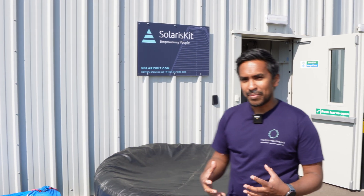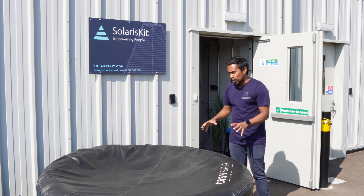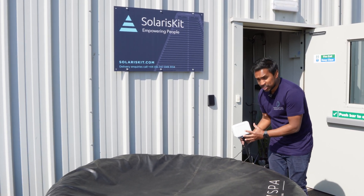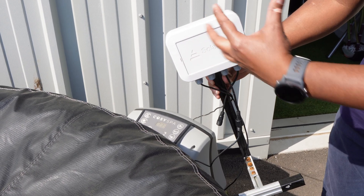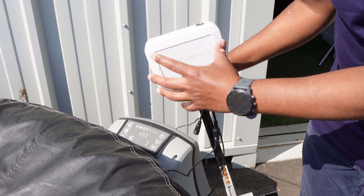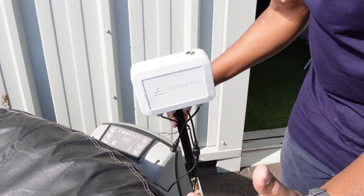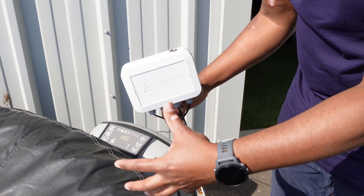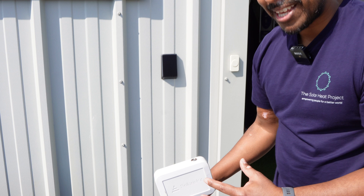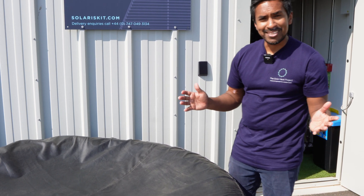To automate all of this, we include a small temperature controller which is constantly measuring the temperature of the system. Our controller is mounted in a box housing a PCB with our electronics and software. It measures two temperatures — one of the hot tub and one of the solar collectors. Based on our software, if there's solar energy available and your hot tub needs heating, it'll turn the pump on and start the heating process. When it reaches temperature, it'll just switch the pump off. It really is just a case of installing the system, pressing the on button, and forgetting about it — the controller automates everything else.